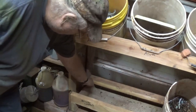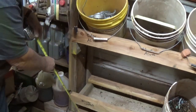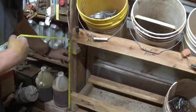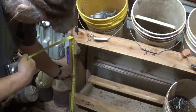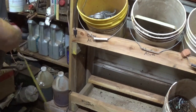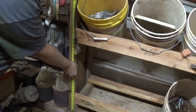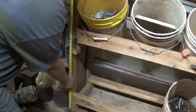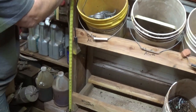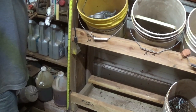You've got your 5 foot 1x4 running upright. You've got your 16 inch 2x4 running across here. So from the very bottom of your 1x4 to the bottom of this 2x4 for the second shelf is right at about 20 inches. Then it goes to 39. And then the top one is about 56 and a half.